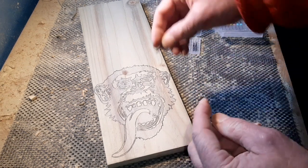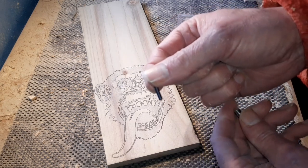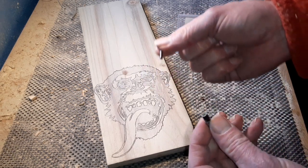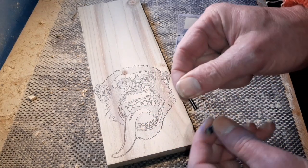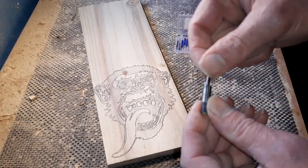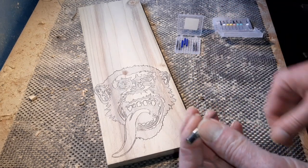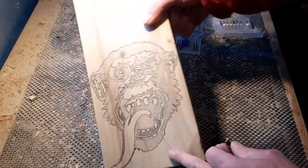And the idea is you literally just slot your CNC bit in. These are nice and sharp. 15 degree we're using today. I normally use a 20 and a 30, but there are some small areas in here, so we're going to go for a 15. And if you just slot that into there, into the silver end, that will fit your router, no problem. We'll go around all the lines, because this is quite small in areas,